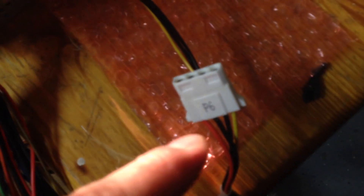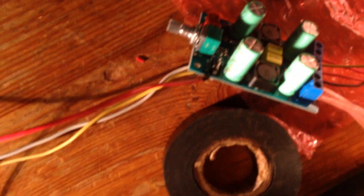I clipped off one of these connectors and clipped the yellow one to power this little board here. The black one I'm grounding in. Our output has a right and a left — there's just a little speaker I had laying around, one there and one there. The input is this little guy here — three pins: a right, a left, and a common ground. I've got those running via alligator clips to a little headphone connector I just spliced.